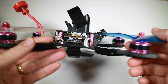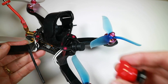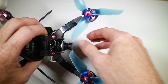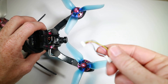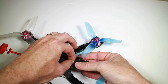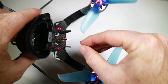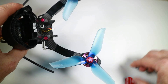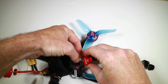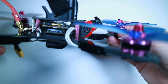I decided to install it in my Coptix, which was running the RunCam Mini Swift — it's about the right size and should drop straight in. For a brand new build I'd use the supplied cable, but going into an existing build I like the fact there's been some standardization in pin ordering: generally it's power, ground, video, and that's common across cameras. So I can just grab the existing connector, line it up at the right part, and connect straight away. Installing it only took about two minutes.